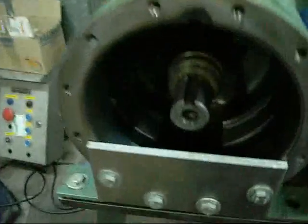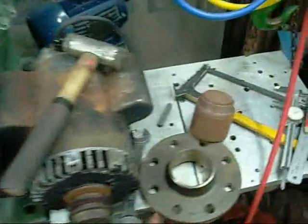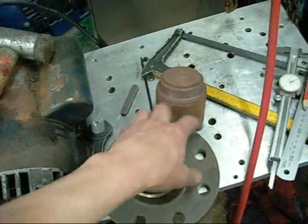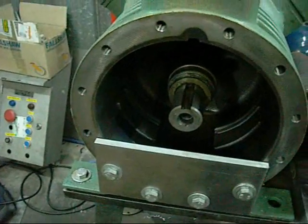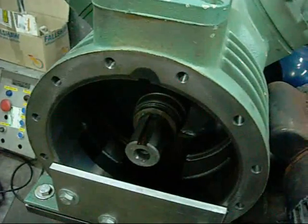If it went all the way through I could probably take it back to the foundry I used to work in and just broach it on the press. But I want it to be a blind keyslot with a smaller diameter spigot on it that I can fit a normal drive pulley to, so I can drive either a belt drive or a flange type direct drive. I'll just open these holes up a little bit and make rubber bushings for each hole, and just use a pin type drive with rubber bushings around them. That will take up any vibration and discrepancies from the petrol engine that I want to drive it with — no use going for a rigid drive plate. If there is even a slight misalignment in the engine and the compressor it will just flog out bearings and cause cracking of the drive plate.